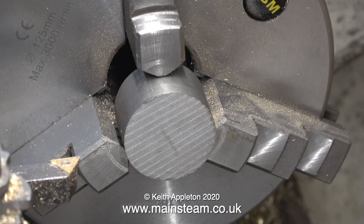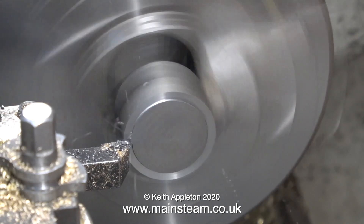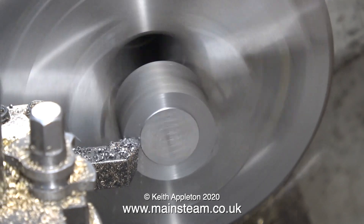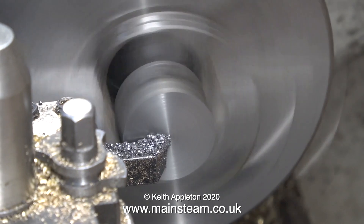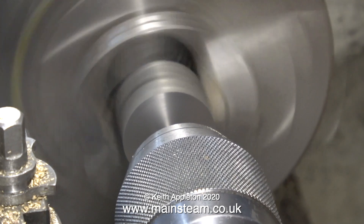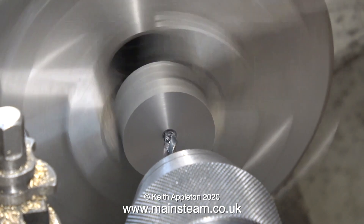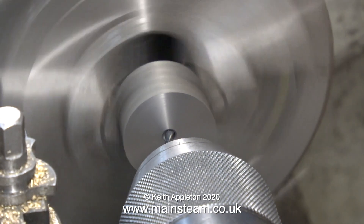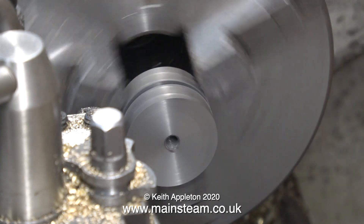Now it's fun time. The first thing to do is fit the piece of cast iron into the chuck and face the front of it using a carbide tip tool. This clip is running at twice normal speed — if you were turning cast iron using a high-speed steel tool at this speed, it would soon blunt. As usual, the next part is to centre-drill the cast iron, followed by drilling all the way through using a tapping-size drill for 2BA, which is 5/32nds of an inch. Now I'm threading the centre hole using a 2BA tap.